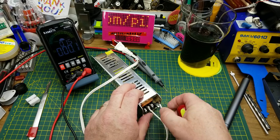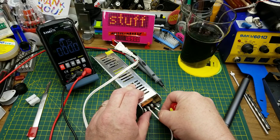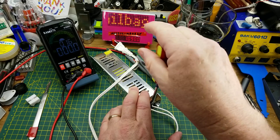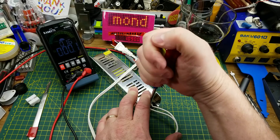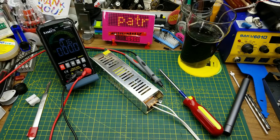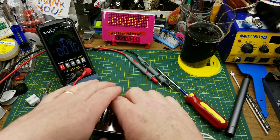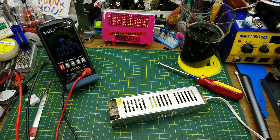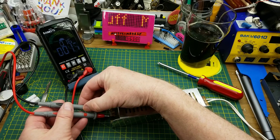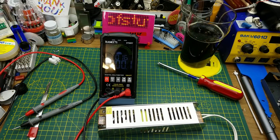The responsible thing to do is power it up and see what it does. I'm going to be a little naughty and use a two-wire cable since I don't have a grounded one handy and stripped. Safety cover on — let's plug it in and see what happens. No explosions, doesn't zap me — good start. Measuring the output: 12.08 volts. That looks like a win.